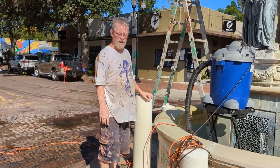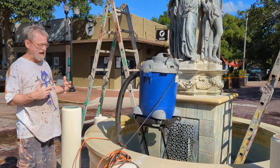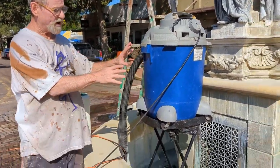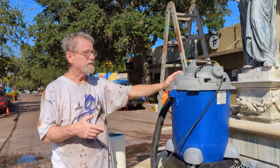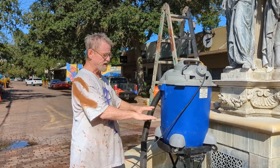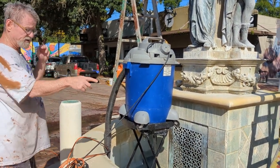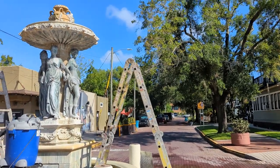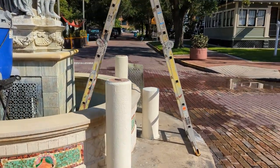So we have this set up to clean the upper bowl and check the netting around to make sure it doesn't need more ties. So we'll need something like this I salvaged to put the wet vac on, because it's going to take a couple of 5 gallon buckets to clean this out, but you'll need to have this raised up on some kind of platform. This one's about 4 feet high. You'll need some ladders that are approximately 12 feet on each side to be able to safely look over into the bowl and clean it. And so we'll just jump up there and start on it.